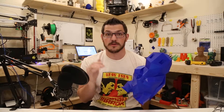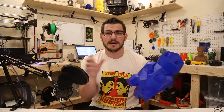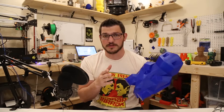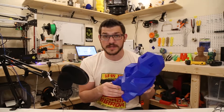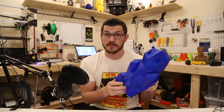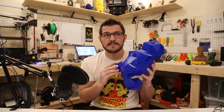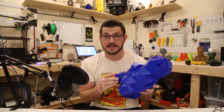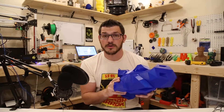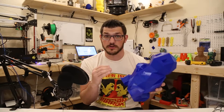So I was like, okay, let's slow it down. I had it printing fast for about the first half because I knew that part would come out pretty well. Then I turned my speed down to about 80% of the 4,500 millimeters per minute, let it go, and woke up to a nice perfect print. This is two perimeters, zero infill. Joel did a video a long time ago — I'll put a link up — about quitting wasting plastic on infill. You can do big prints like this without any infill at all; you just need appropriate settings and appropriate cooling for your 3D printer's print cool fan.